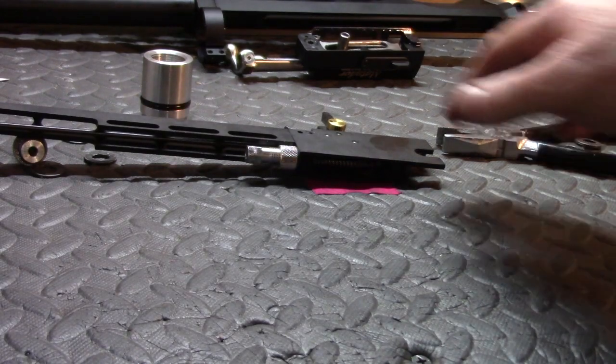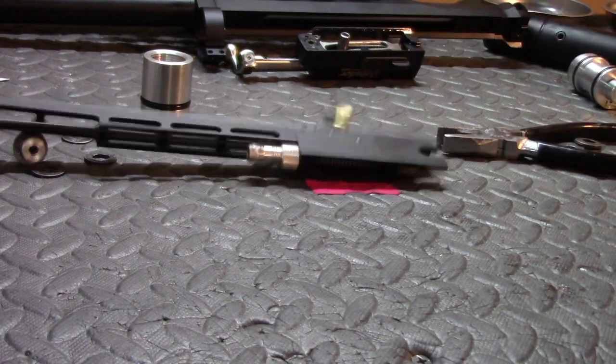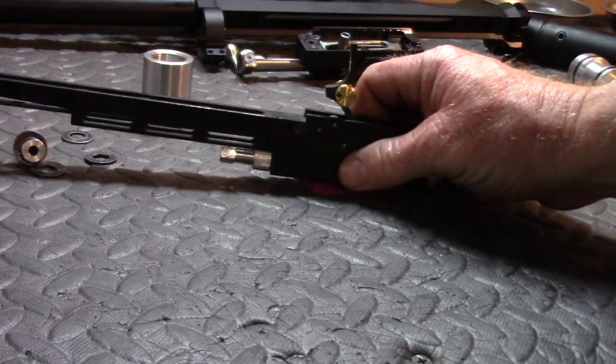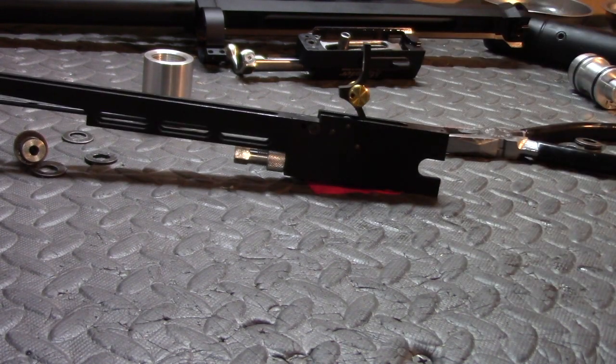So you have two choices when deciding how much valve dwell time to initiate in your system. Choice one is to crank the hammer spring tensioner up and smack that valve as hard as you can, providing enough force to open the valve for the proper amount of time in order to get the volume of air out of the plenum.